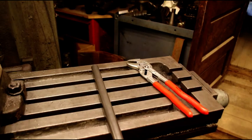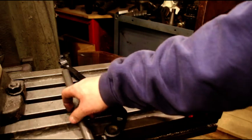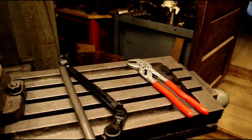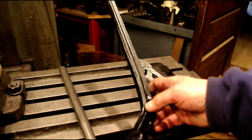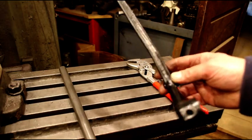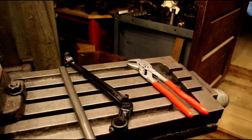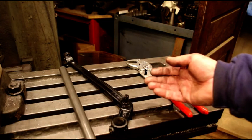You can get a new pedal - it's not a big deal - but I haven't found any good pedals. They're all coming from overseas somewhere. If you could find a new old stock one, that'd be fantastic. I've taken some of the new ones and just as a test I would drop them from bench height onto the floor, and I've actually broken them before. I do not trust overseas junk when it comes to a brake pedal - if your brake pedal breaks when you put the brakes on, you've got problems.